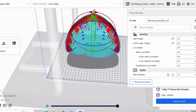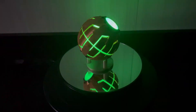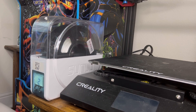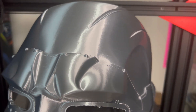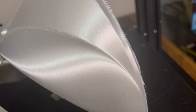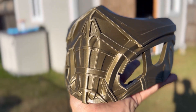One big tip before printing: silk filaments are a magnet for moisture. I definitely recommend getting a filament dehydrator and running your filament three to four hours prior to printing, then leaving it in the dehydrator while printing. This pulls any moisture out and keeps moisture from building up. Properly dehydrated silk comes out uniform with no impurities or blemishes. Without dehydration, you'll get little zits or blips — a direct result of moisture in the filament. That happens, and the print is pretty much ruined.